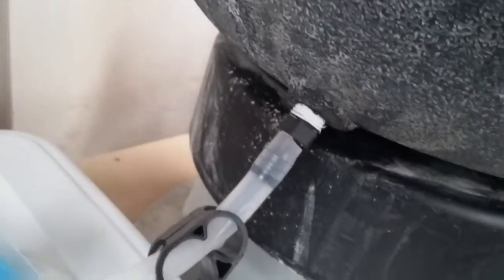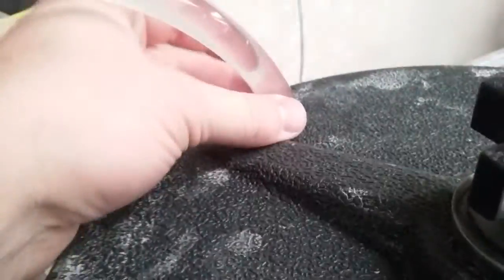And as you can see, I kind of reversed their setup as it comes from the factory. This little insert here, which was up here, and the plug, which was in the bottom, I just put up here because this line that I have for the pump just isn't gonna fit in there. So I just drilled a hole real tight and even had to open it up with an X-Acto knife, which is real easy. It's nice soft plastic. But it's got some line running straight up to the other side of the tumbler.